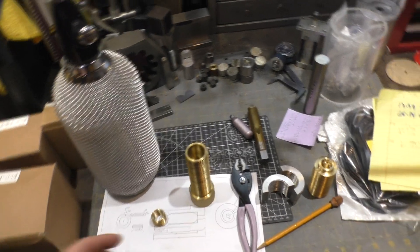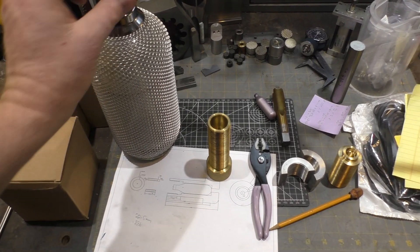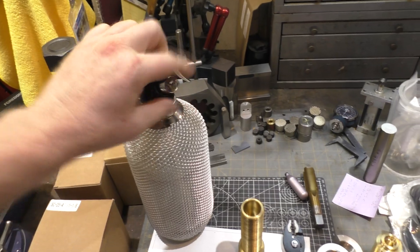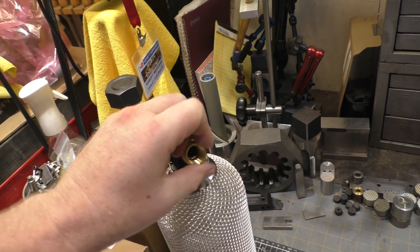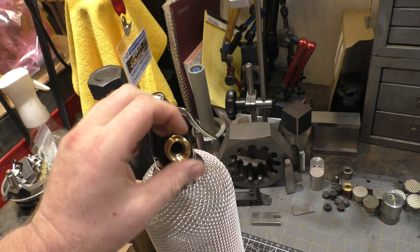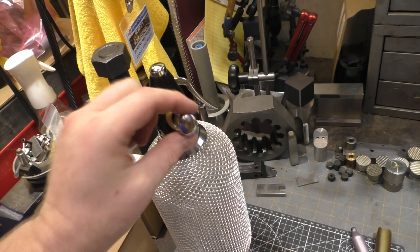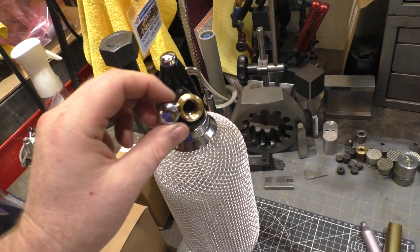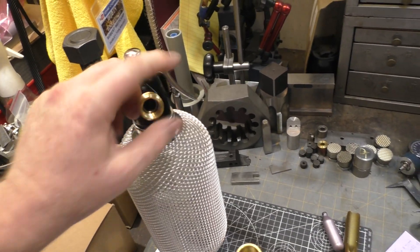You make one part and it leads to another. We made the threaded bushing - smaller threads on the inside, larger on the outside - and it threads on here. I was going to slot it to tighten it down but that's not really necessary; it gets plenty tight. However, once that piece threads on, the cap that normally sits on there to protect the threads will no longer fit, so we need to make a new cap. Then finally we'll make the tube that holds the CO2 cartridge.